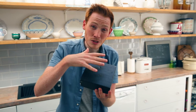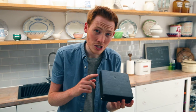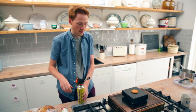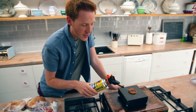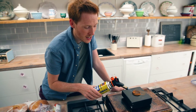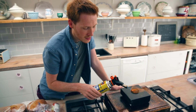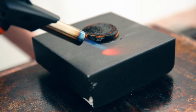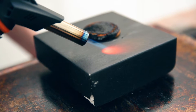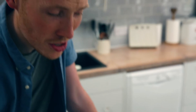This tile can take 1,600 degrees on one side for over 15 minutes and it would be lukewarm on the bottom. I want to compare it with the ginger nut. The centre of this blowtorch is about 1,400 degrees C, and you'll see my ginger nut doesn't really last very long — the heat spreads and it starts to release gas. By comparison, if I move over to my Buran tile, you'll see it slowly starts to glow, but that glowing spot doesn't move anywhere else in the tile. The heat is contained, and actually the flame of this blowtorch is a similar temperature to that which it experiences during re-entry.